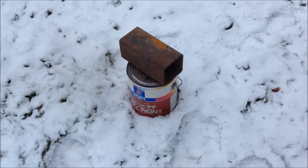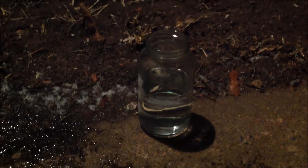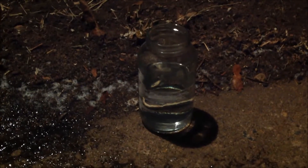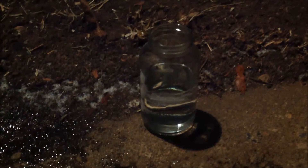As you can see, I put a lid on the reaction chamber to help keep oxidation to a minimum. Now the thermite has cooled and I've chipped it out of the terracotta flower pot, so I'm going to add it to water in order to hydrolyze the aluminum sulfide by-product produced and free up the silicon and aluminum oxide.